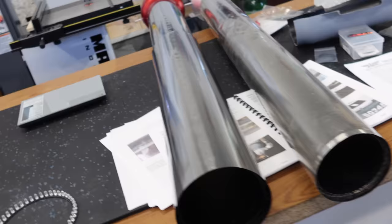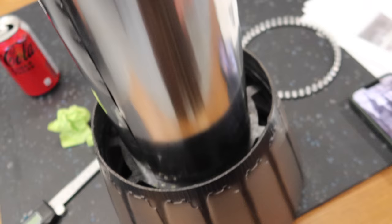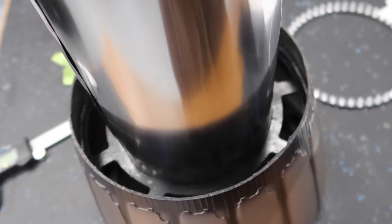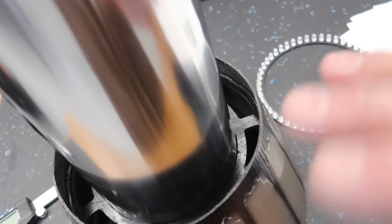We're going to have to get rid of almost all of those little tabs on the tail cone, but of course we'll measure and make sure we get the right amount. The simplest way to get this set up: we've got the tail cone sitting here, put the pipe on top of the tail cone, and you can see we're basically getting rid of the tabs and the pipe's going to be resting on the entire ring — which is totally fine. The afterburner light also has a little bit of space, about five millimeters between the inside of the afterburner ring and the new pipe. Well thought out and should work awesome.